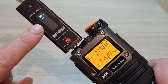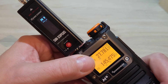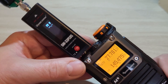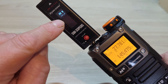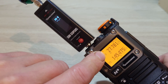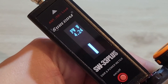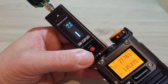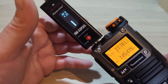Just while I've got the power meter connected — incidentally this power meter is only designed for VHF and UHF, not for HF frequencies such as CB channel 19. There's a lot of speculation about CB frequencies putting out spurious emissions on various frequencies including the air band. I'm still running into a dummy load, so this is a quick test. The power meter only measures what's coming out of the radio — it doesn't know what frequency it's on. A quick press of PTT into a dummy load shows 4.22 watts out somewhere. We don't know where that somewhere is, but hopefully that's a good demonstration as to why we shouldn't be transmitting out of band on frequencies the radio is not designed for.